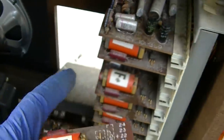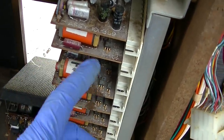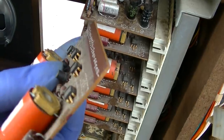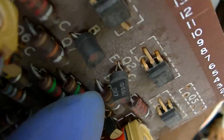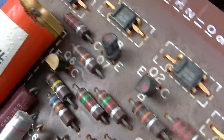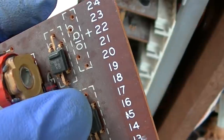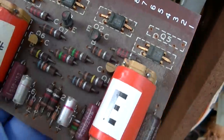And I tried changing. I flipped this one and this one, and then of course these two keys on the keyboard started working. I put this back in and now it's working. I suspect those transistors a little bit, the Q7 and Q2, that package tends to be an issue. These are the divider ICs, these little 6-pin things. I'm sure those would be fun to try and get.